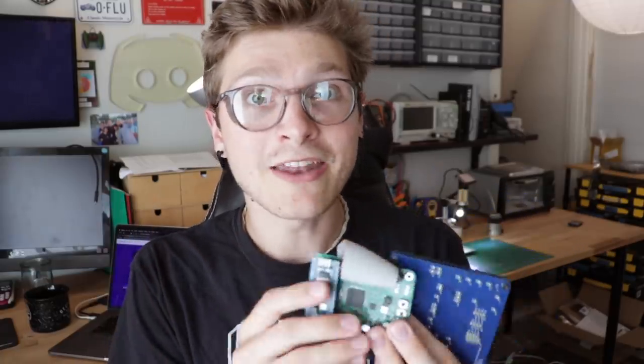And then the last part, which is the code. So of the code that needs to run to make this happen, there are three portions. The first is the firmware that actually runs on the controller. This is gonna be the code that checks to see that the I2C bus is up and running, the SPI bus is up and running, and also probing all of these pins out here to see what response it gets from the target board. The way I'm writing it, it's pretty much just gonna listen over serial for some command, and then based on whatever command it gets, it'll run a test, and then it'll just barf the result of the test back up through the serial port.